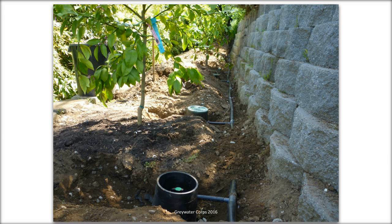And that's important because there is stuff in gray water. There's laundry lint, there's soap suds. Any kind of time you're setting up soaker hose or drip line, it's going to clog with gray water. And you're not allowed to spray gray water. In California, it has to be 2 inches below grade. So you shouldn't ever actually be seeing any gray water. If gray water is daylighting, then that's a potential code violation in California.